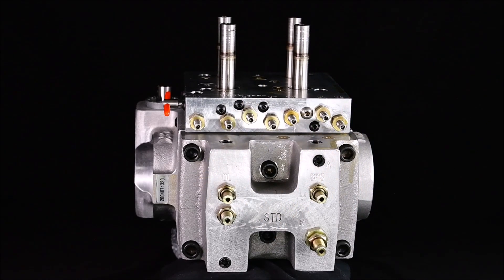Your solenoid tubes on the up section — this is the 4M valve, so everything is being presented as if this were a 4M. The back solenoid tube is up leveling; the front solenoid tube is up high speed. On the down side, high speed is in the back and leveling is in the front. So they change places — they're kind of catty-cornered from each other.